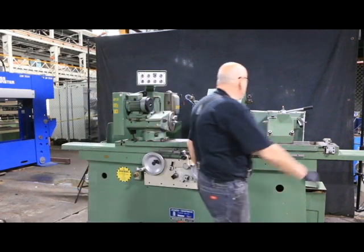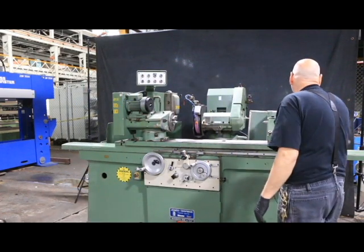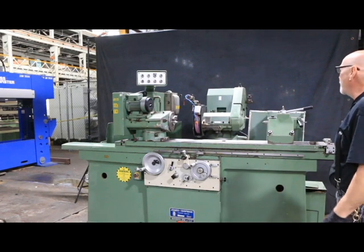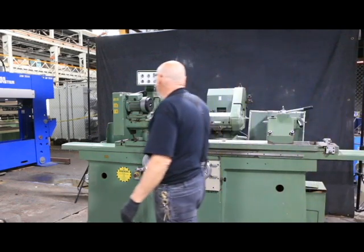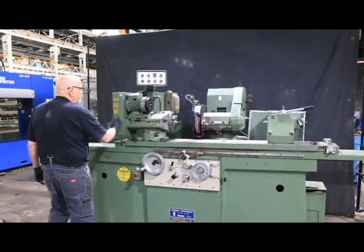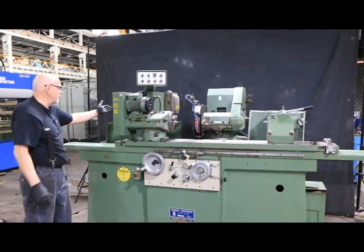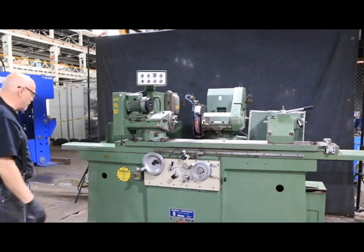You've got a pretty impressive, heavy duty size tailstock here. You've got an indicator here for table adjustment, taper adjustment, ID spindle on the back, and variable speed in that you have to change a couple of different pulleys on here. You have certain speeds which will be listed or seen in the photograph of the label.